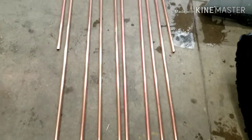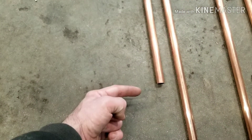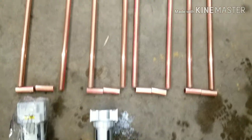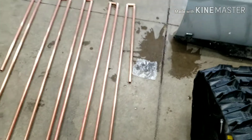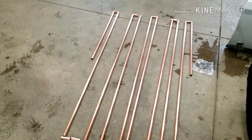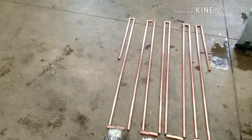So there's the basic idea — we've got a rough cut laid out of what it's going to be. The air is going to come in right here from the air compressor, then go up and down to the first filter, then all the way up and back down to the next filter, and so on. There's going to be a filter in the last two spots as well, and then the air will come out right here, hopefully cool and dry. Copper is very good at conducting and dispersing heat — it's kind of like a radiator in your car.